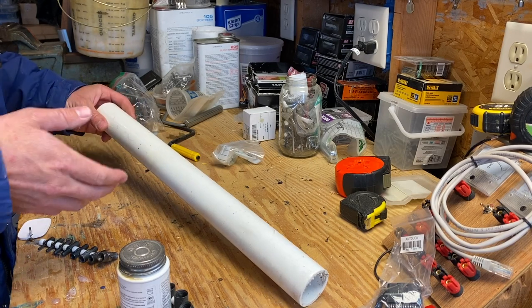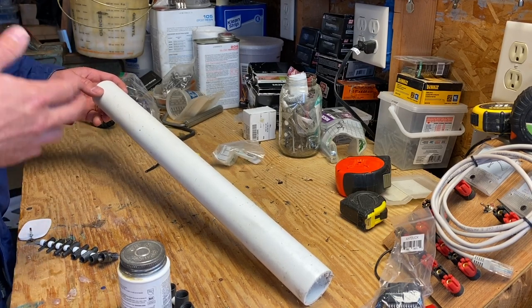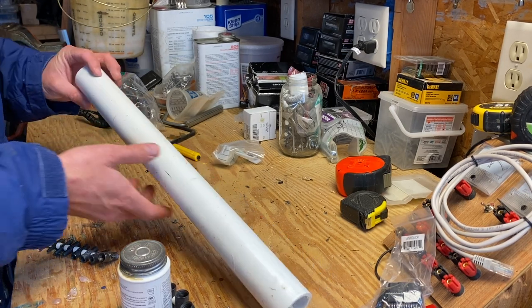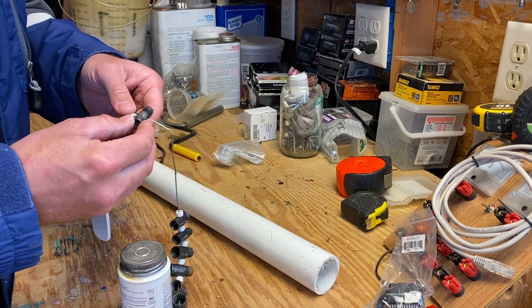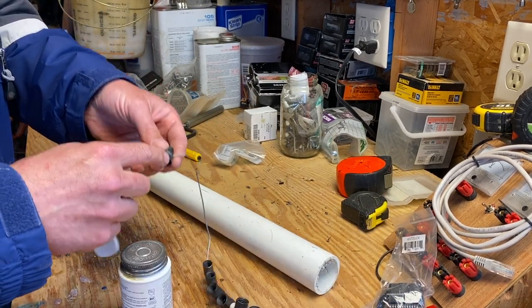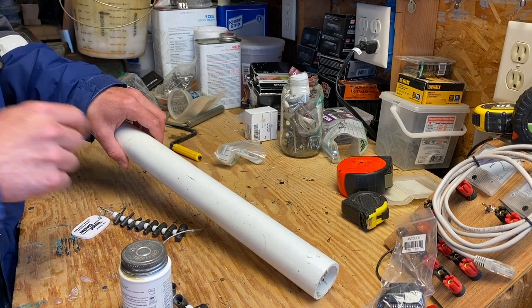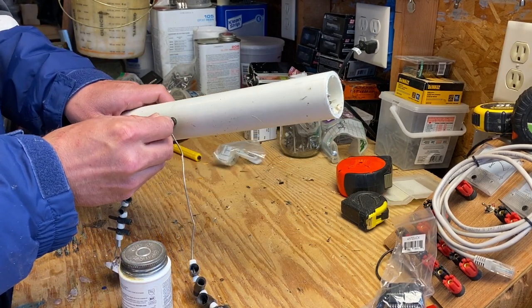I just wanted to take a minute and show you guys how I made the threads for the chicken nipples. I should have filmed all this, but because of COVID-19 I've been watching my son, so I don't have a lot of time to set up the camera. I'm usually just cranking along when I have a spare few minutes. So this is just an extra section of one and a half inch PVC pipe. The chicken nipples are 10 by one, and this is just a thread checker I had — I bought this on Amazon. I used this to check the threads on the chicken nipples. They are plastic, and if you just try to thread them right in after drilling the hole, they will just be garbage — they're not going to catch and go through this PVC plastic. So I used this thread checker to create threads after I drilled the hole.